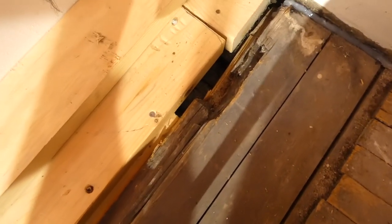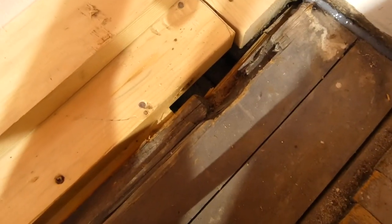And the other part's over here. So with the flooring removed, or the piece of wood that we're going to have the radiator sit on removed, we can see, all right, there's our PEX. We want to pick that up on this side. And we can see where we got a circle from the hole above, and that is where our PEX has to come out. So let's take a look, remove that, and it looks like it's over the beam too. So we might have to notch that 2x a bit.